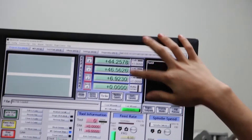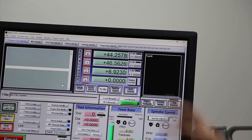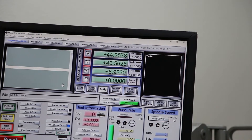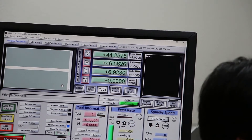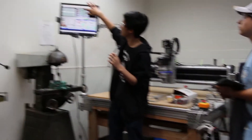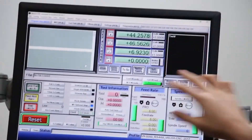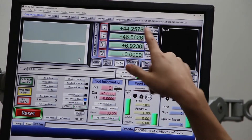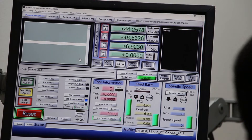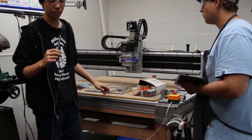After that, you'll look at the digital readout, which are the DRO inputs. You can think of each of these as a coordinate system in inches, and they allow the CNC to know exactly where it is. There are four buttons next to each axis — X, Y, and Z. Don't worry about the fourth axis since we don't have one. The zero button sets a given axis value to zero, which is important for cutting out parts on the vices and on the sheet metal.